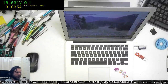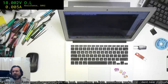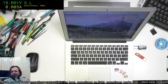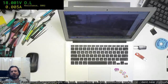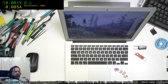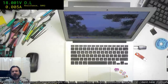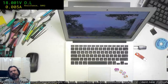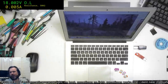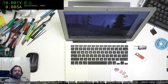Yeah, speaking of Lewis, I do have to fix up his software for his multimeter and his power supply. He's encountering one of the classic issues, well, one of many issues that Linux has, in that when you reset the computer, it's luck of the draw as to what USB ports get assigned to what devices. So what I need to do is improve the software so that it'll actually check the available connections, in this case COM ports, and query the device if it is actually able to be opened, because if there's an exclusive lock on it, clearly it's not the one we're after. And then, as well, query, and then listen for the data, see if it works. If it doesn't, move on to the next. Things like that, basically to make it Lewis proof. That's what I need to do.